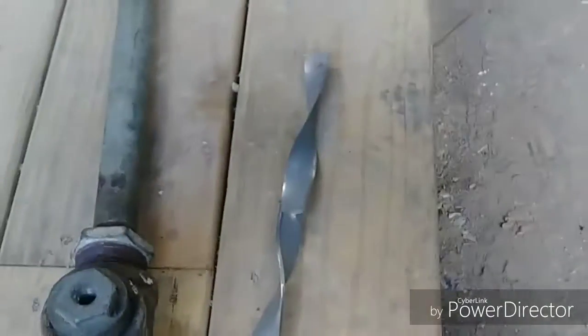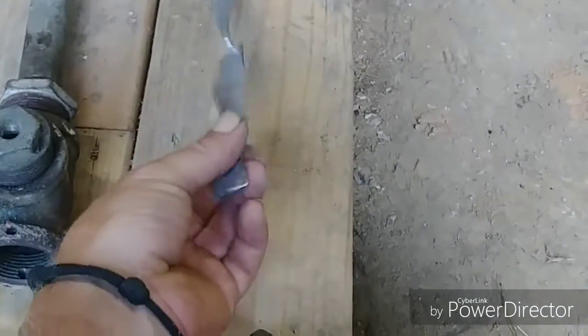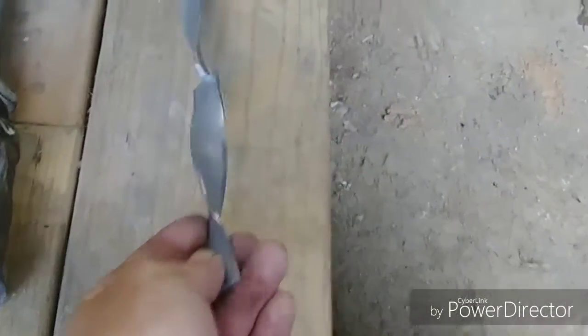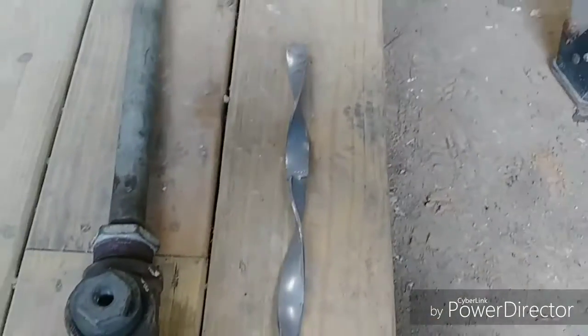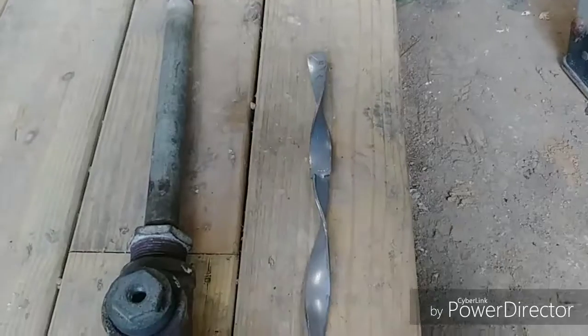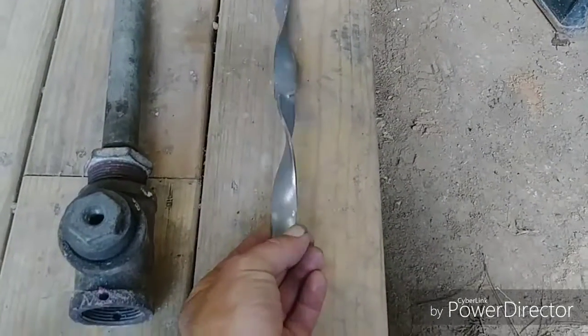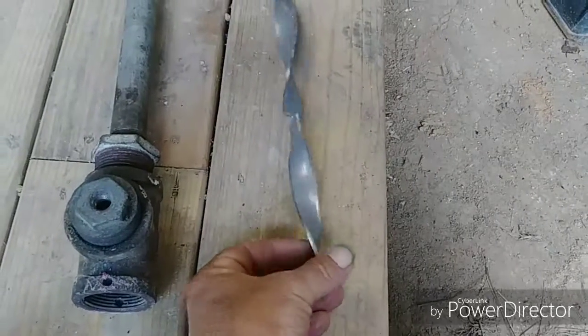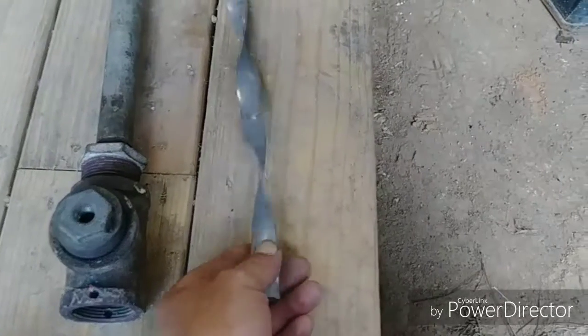Before that goes in there, we have this piece here — this is what I was telling you about. I wanted to create a little impeller, and what I've done is taken a piece of flat steel, cut it in the middle, and started twisting it. The twist is not consistent — I twisted from different parts of the steel because I wanted the air to trip over itself trying to move around in there, to get it to mix.